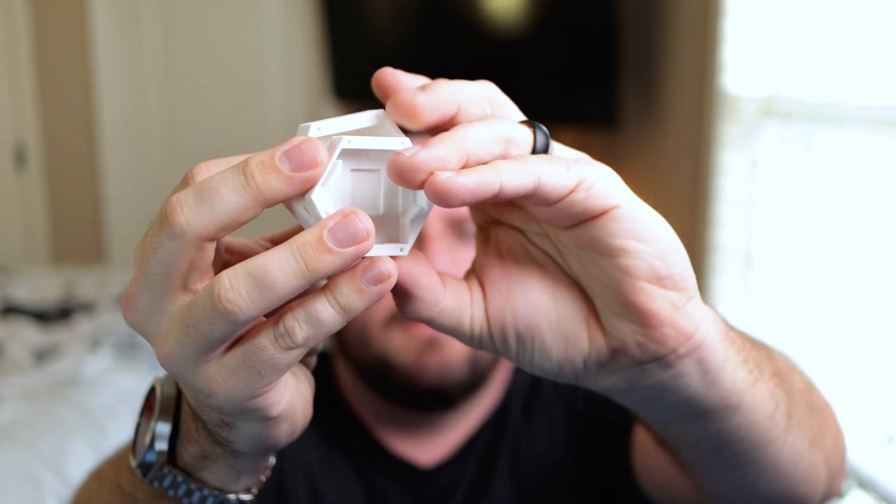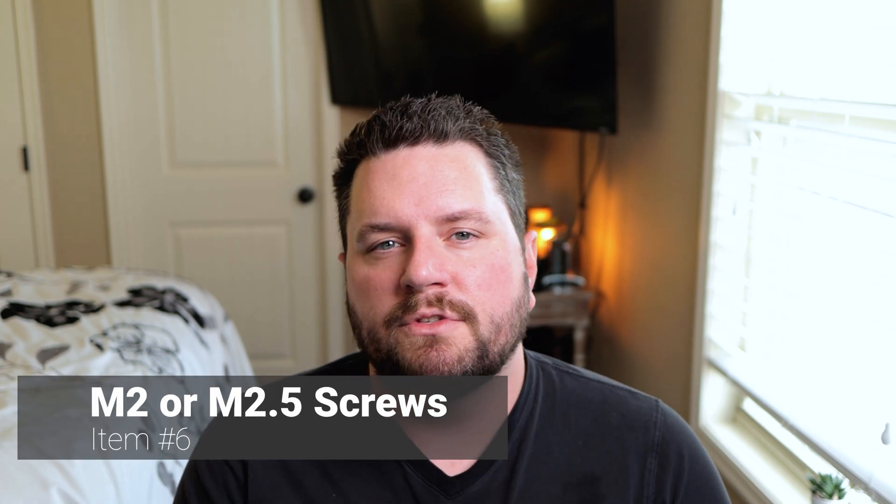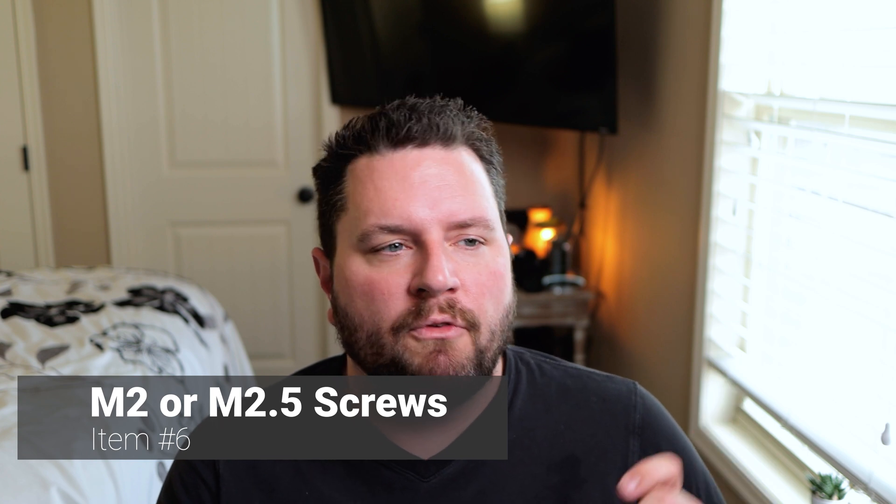Because my ESP32 is slightly bigger than a standard ESP32 or D1 mini, I had to print the enclosure at 15% larger — 115% on all three axes. As you can see, the original size is here, and the one I printed for my instance is about 15% larger, big enough to hold my ESP32. You can scale this up if needed. For miscellaneous hardware, I'm using M2.5 screws for the larger version; if you're going with the D1 mini size you can use M2 screws. Self-tapping screws are great — links to a pack are in the description.